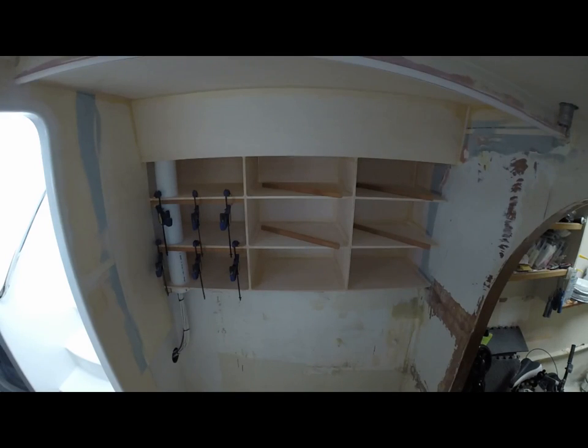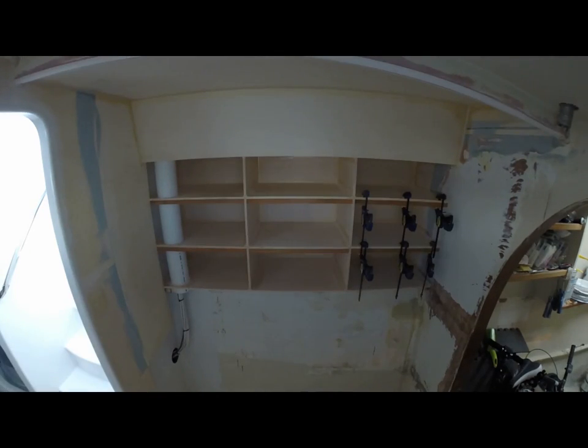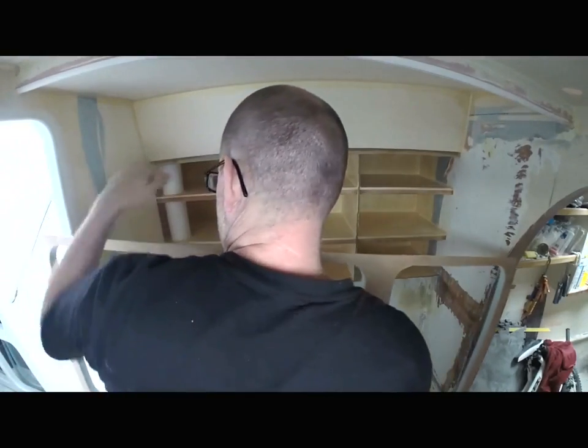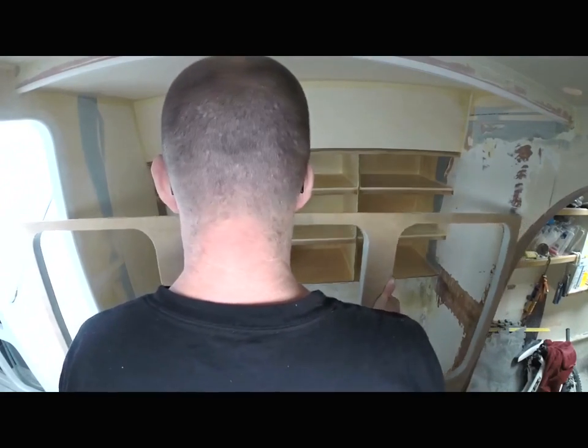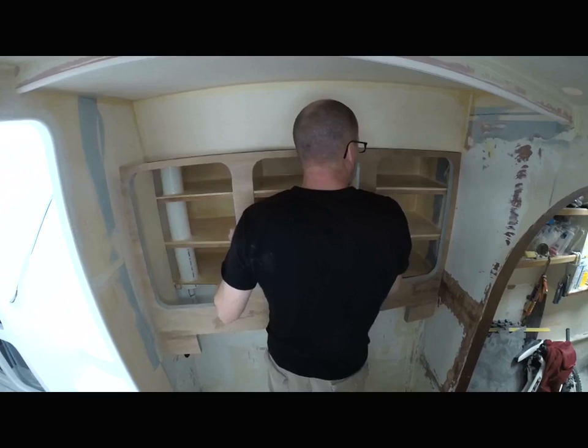After the shelves were all in, I had to put a shelf edge on. The shelf edge was for two reasons. It stiffens the front edge of the shelf, and I have a little stainless detail that goes on the front of each shelf, which gives me something to attach it to. I built the face frame outside of the room, shaped it, and just attached it all as one unit. It worked out pretty slick that way.